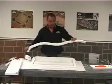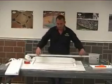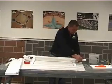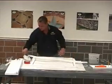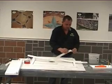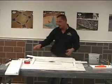Now, you're probably wondering what to do with the crinkled up piece. Just leave it there. Go ahead and apply your double-sided stick tape. Put this in the place where you'd want it on your casting deck. Once it's affixed in place, you have it put where you want it. Remove this. And recoat the surface with the clear facing tape material again, and it will yield you a completely smooth inside or outside radiuses.